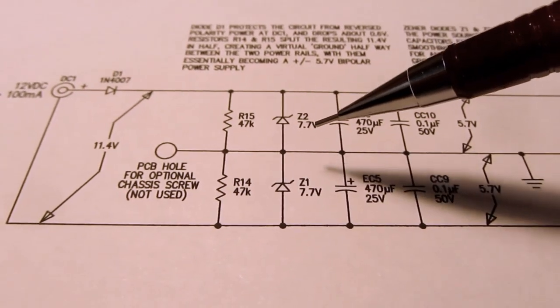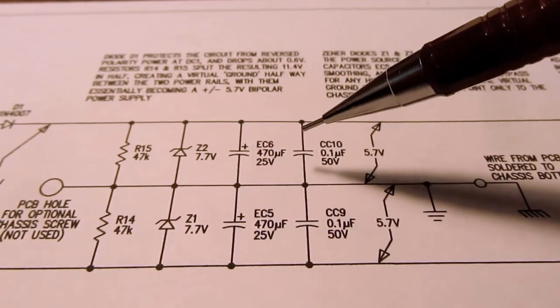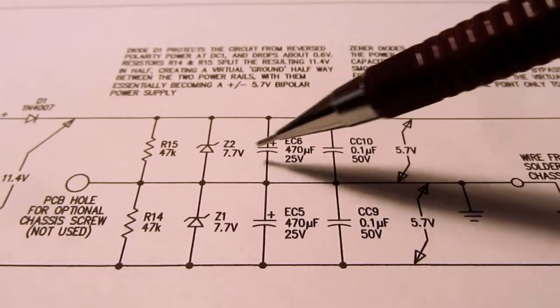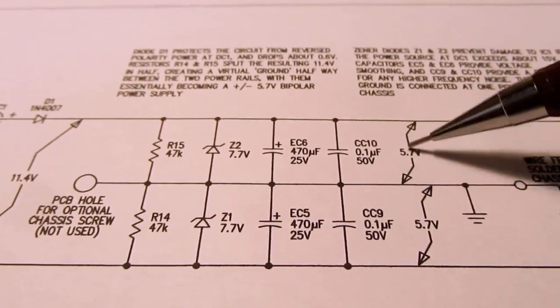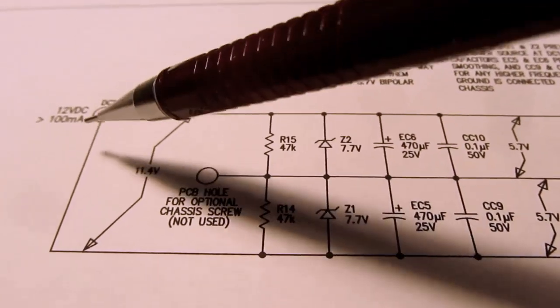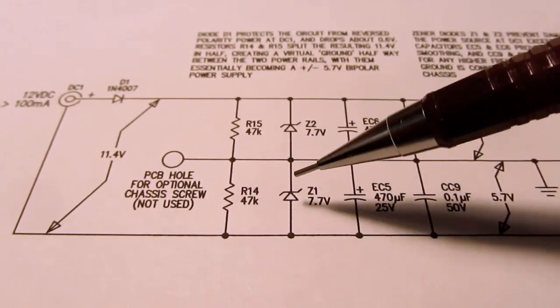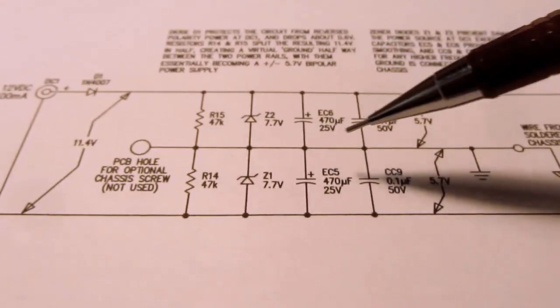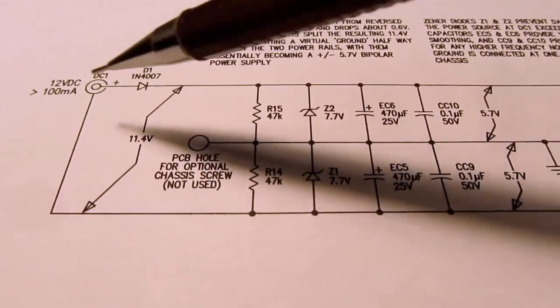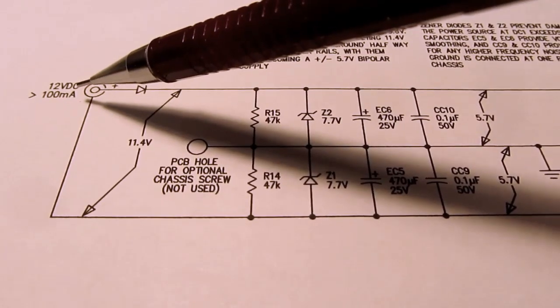I just rounded it to 7.7, so that's already about 2 volts higher than the voltage you would normally get from 5.7 to 7.7. And since this is a regulated supply, it should never go high enough for these Zeners to start conducting. So what these are is protection for the op amp in case this thing malfunctions, or if you plugged in a different power supply